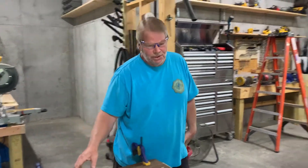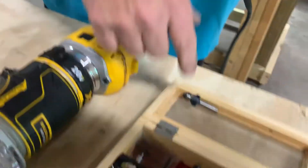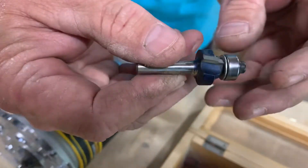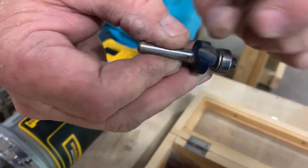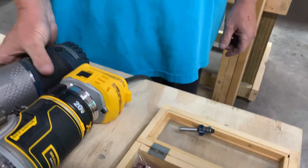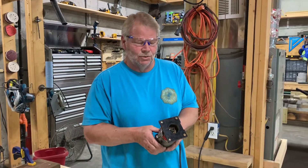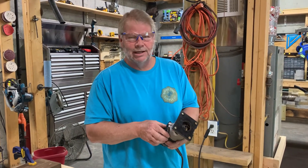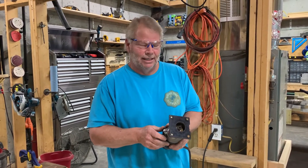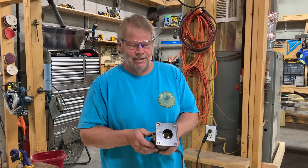First thing I want to show you on this router — these are your bits. We've got a little small set of bits here. Something I want you to notice: the cutting edges on these bits are like razor blades. So if you can imagine a razor blade spinning around at 10,000 RPMs, that's a router. This is a very dangerous tool. It does a lot of really neat things, but make no mistake, this tool is very, very dangerous. You've got to be really careful with it. I've seen some horrible accidents where somebody let this slip out of their hands and it ran up their arm — ended up with almost 100 stitches. So just be very careful when using a router.